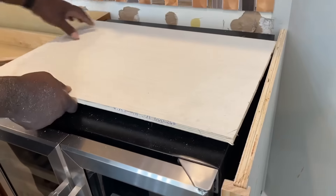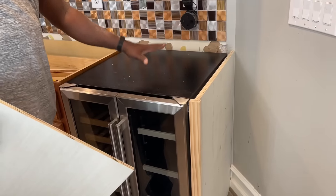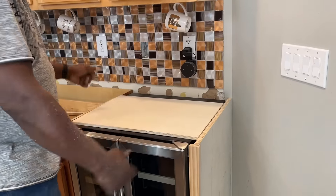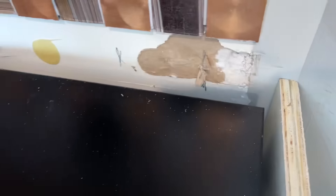This is a half-inch piece of plywood, and I thought the measurement from the top of the wine cooler to this was a half inch, but it's a little higher than I'd like, so I need to go down to three-eighths. The countertop — the granite hard top — will be resting on this; this carries the weight. This piece is serving as a shim and also as a tie-in from this side to this side so nothing moves. I don't have three-eighths plywood but I grabbed some off the old countertop and it works — flush and flush — and gives enough room for the cooler door to get in and out.